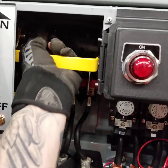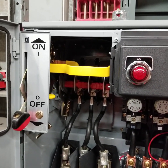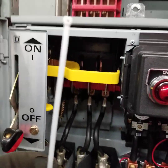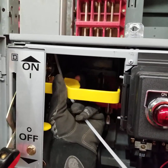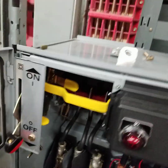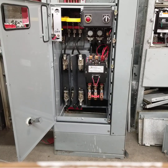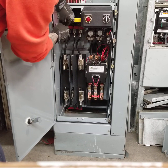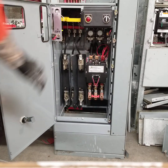Sometimes pulling on this mechanism can be pretty tough. You really need both hands. A trick I've learned is to take a tie wrap and fasten it right around these two mechanisms together, keeping the clamp down so you can grab out here and get a good grip. I'll go ahead and put that tie wrap around the interlock, get it nice and tight, pull it back, and secure the tie wrap.